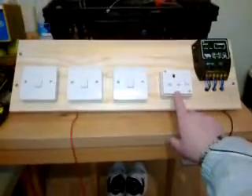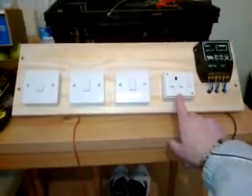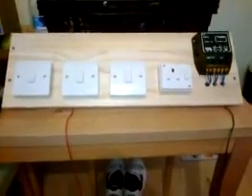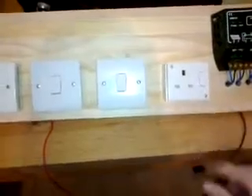I'm not going to spend a fortune on really expensive analog gauges since I've only spent a small amount on this so far. It looks simple and it is simple — it's really basic, just a bit of fun. It will power lights in my shed and keep my radios charged up. I've got a 10-watt panel about a foot square, which is enough to trickle-charge the system. Tomorrow I'll connect the wires to the battery bank and plug in the solar panel, then wait for the voltage meters to turn up. There are holes on the top of the switches so I can run the live into the voltage meter and the negative behind the board to the device itself.